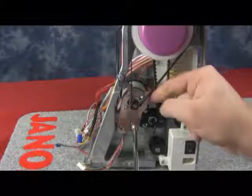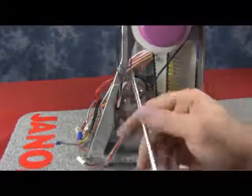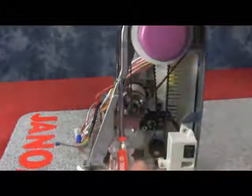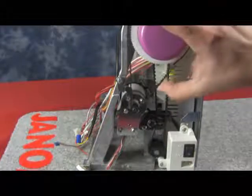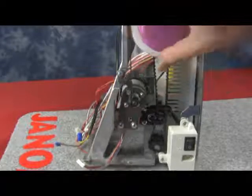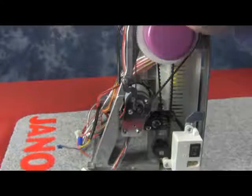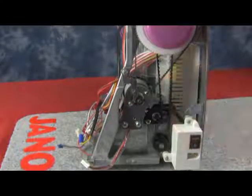When you're sure that you have it, make sure the screws are tightened well, and tighten the bracket as well that goes into the casting. Always turn the hand wheel and feel how it feels. Our deflection is good. That's good.